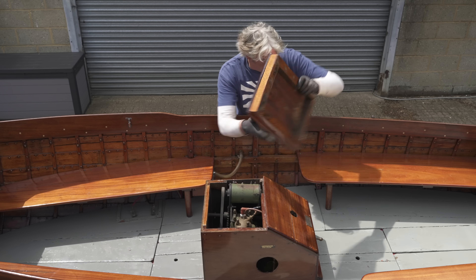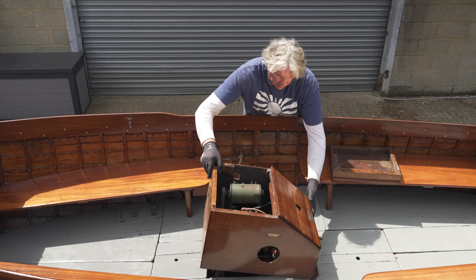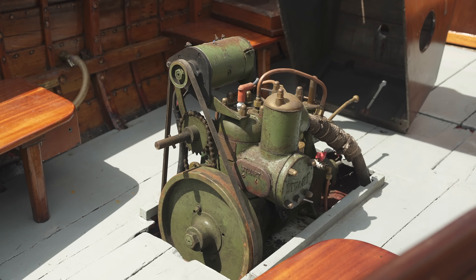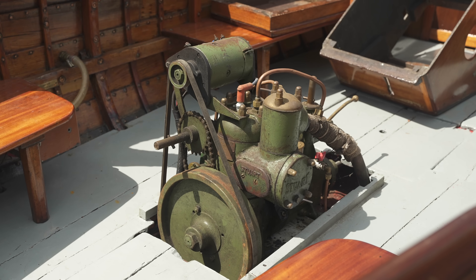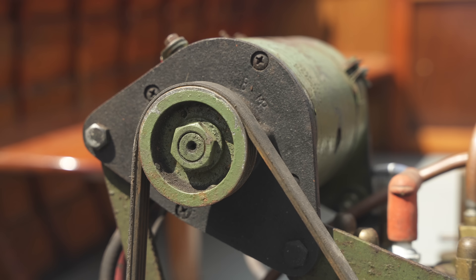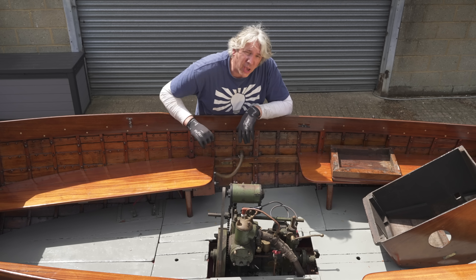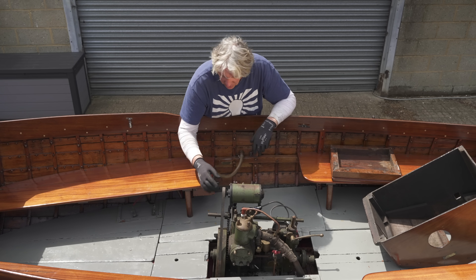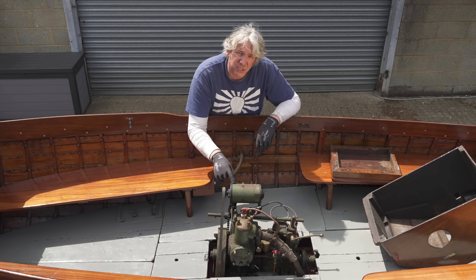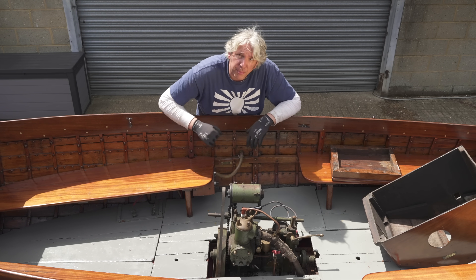So if I just take off the lid, it reveals our little engine here. And then with a little bit of deft movement around the throttle, which is on the back, I can reveal our little original Stuart Turner engine. This is a four-horsepower P5M. The M stands for Marine, so it's a marinised engine. It's also got this thing called a Dynastart — it's like a dynamo but also works as a starter motor, so this is like a sort of optional extra at the time. Looking at the engine numbers, they were made between 1958 and 1966, so chances are it is the original engine for the boat, which of course is 1958. Quite wonderful.